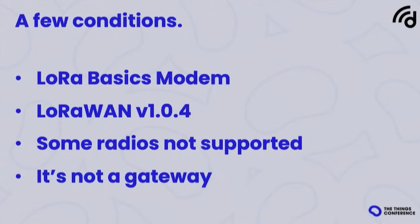For those that are using the 1270 series of the Semtech LoRaWAN or the LoRa radios, up until very, very recently, those were simply out of the opportunity. The relay specification takes advantage of unique hardware or unique improvements in the newer radios like the 1260s and the 1280s and the 1120s. But fortunately, they now have experimental code. This is available directly on the Semtech GitHub repository, so you can have your engineers download this and immediately start testing with it. Other than that, everything else that I mentioned is officially supported, aside from the experimental code. But the good news is that really just about anything out there can be updated, provided that your device can accept the firmware update over the air, or if you have another way to get that firmware in there. Otherwise, you're probably going to be only doing this to your newer devices.